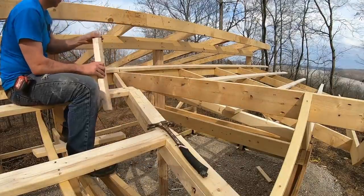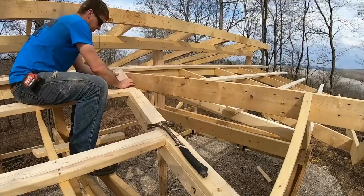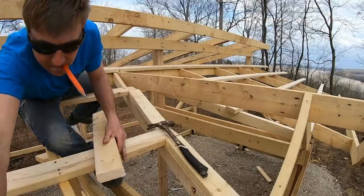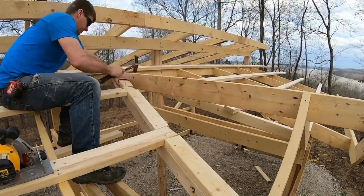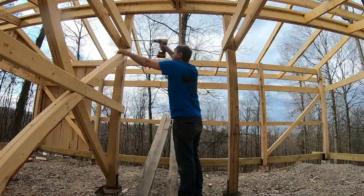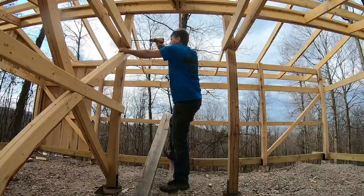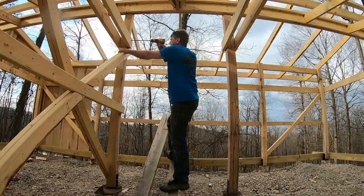So there's supposed to be a big storm rolling later that night, and in fact, it was a pretty bad storm that came through, and I knew that was coming, so I wanted to get some more cross bracing done, but I was hoping to get enough done that I could show you how this valley is going to frame in. If you can just imagine from this blocking that I'm putting in here, some rafters run up to the top of that ridge. It's not too complicated of a gable. It's more for form than it is function, if we're being honest, but we can't see it from the house, so we do want it to look kind of nice, and there'll be some more detail on how that all frames in whenever we actually put the roof metal on.